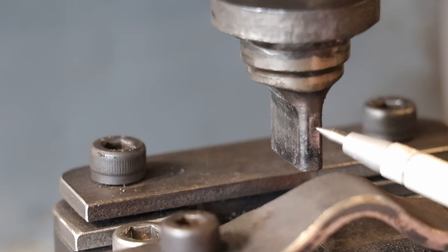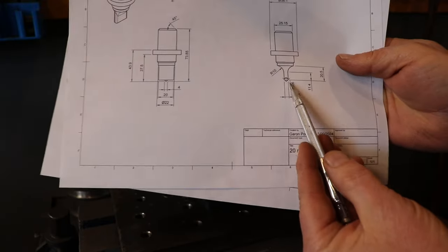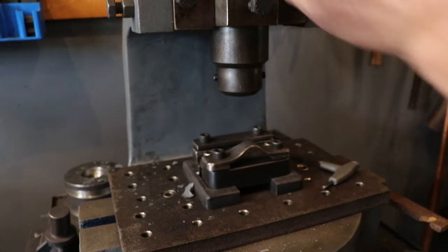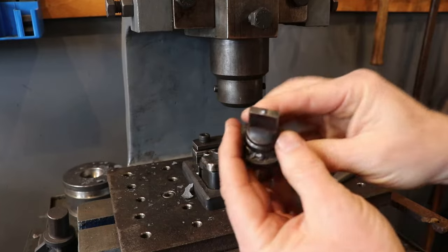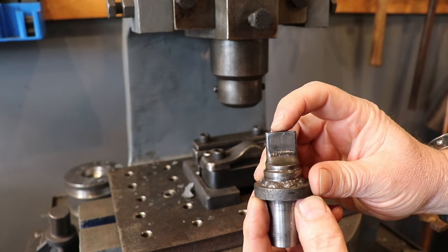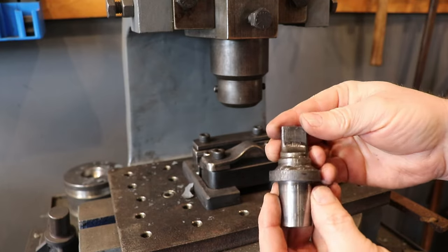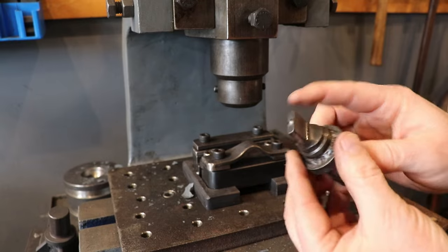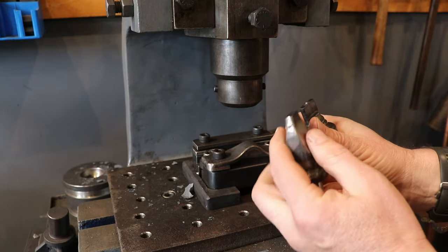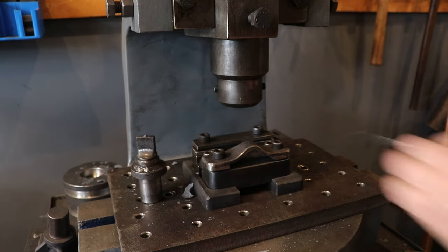The punch material is H13, and I modeled it after an ironworker punch — meaning on the tip there's a little center point that puts a center mark in the material before it punches through. The edge is a little shiny but for H13 this has held up quite well. I mentioned in a previous video that I much prefer to forge the punch — I think it's a lot tougher and really manipulates and directs the grain for a stronger punch than machining, but this has worked pretty well.